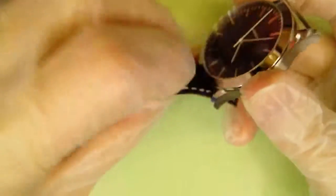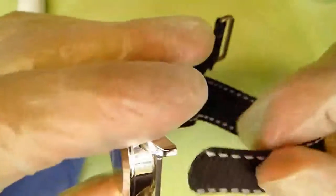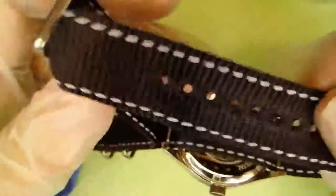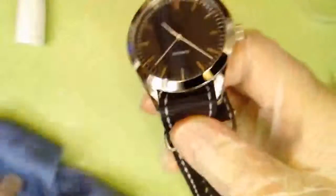That's how you adjust the regulating lever — don't touch the hairspring stud, and then test and refine. It might take a couple of tries, but you'll eventually be able to get your watch running pretty accurately, and if it goes out of accuracy you know how to fix it again. Now that you've seen the process, you know how to do it on another watch. Keep in mind the regulating lever and hairspring stud may look different on another watch, and if there's any question in your mind, don't do it — have a watchmaker do it. But with Seikos and ETAs, most of the time it's pretty obvious what's the regulating bar and what's the hairspring stud. Cool thing to do — adjusting the speed of your watch. Enjoy it, have a nice day.